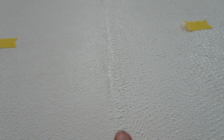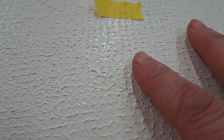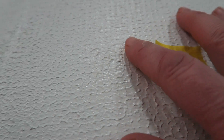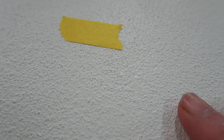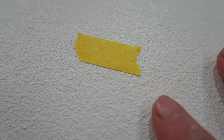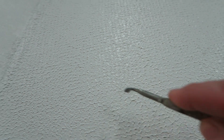It is the following day and both of these samples have set up. I've got to be honest, I might be a little biased, but they both look really nice. I put a couple pieces of yellow tape on here just so the camera has something to focus on. These are two very, very different styles of non-skid. This one over here is a little bit more common — something you'll see more often on older boats, kind of that rolled-out look. Whereas this one over here is something you're going to see a little more commonly on newer or at least restored boats. It's been less than 24 hours since I laid up the last application of finishing gel coat, but after only about 16 hours it's still very hard and very scratch resistant.